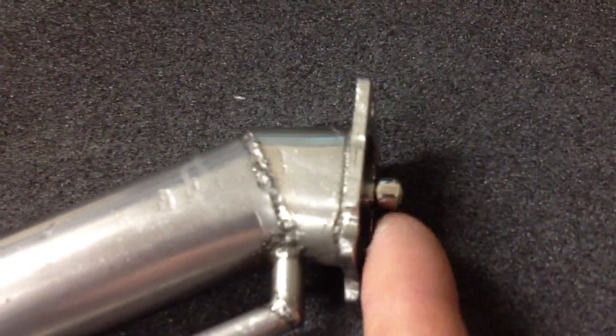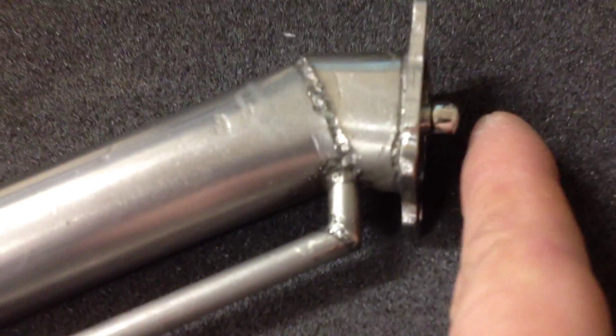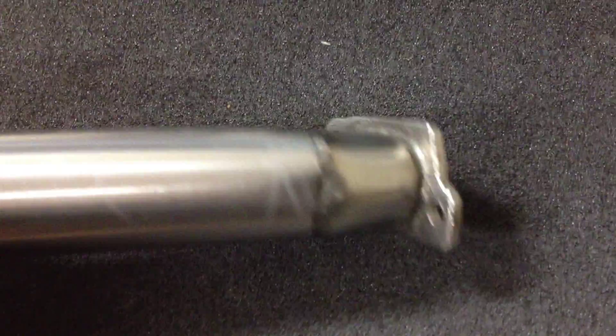Now this is my HHO inlet — it goes through there. As you can see, it protrudes 6mm or so past the baseline. That's to get it as close as I can to the inlet port which sits about there. I'll run through the photos with that and you'll get a clearer idea of how and what.